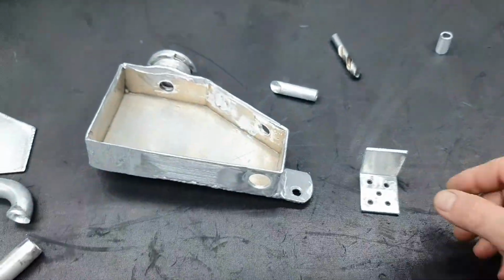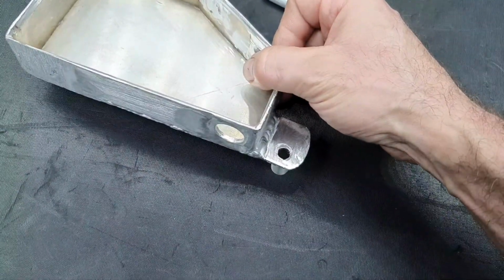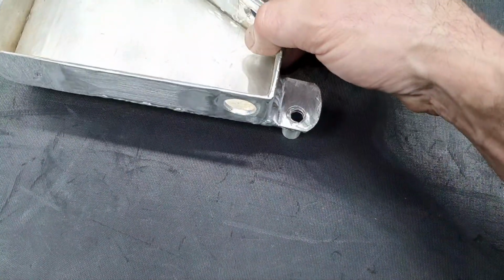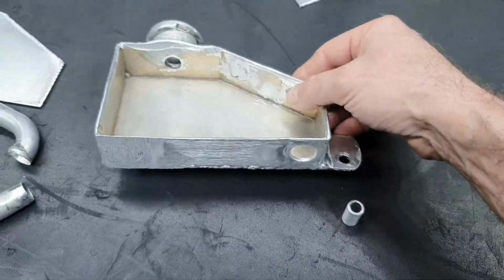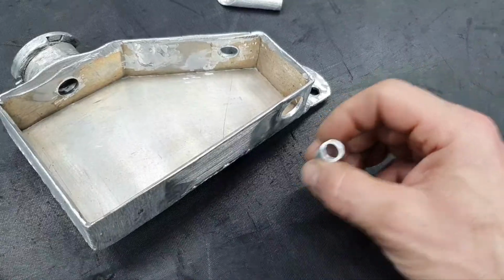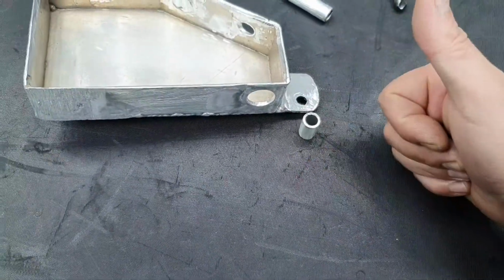Now, before I go there, there was this spacer behind this, and when you're opening the bolt, what's happening? This spacer fell down. We're gonna change that. We're gonna take the spacer and weld it onto the bolt, all right, to come together with the tank. So whenever somebody wants to remove it, they don't have to look for the spacer, you can easily lose it, or you might not pay attention, it might fall down and you're never gonna see it again. So it's gonna be welded here to be attached, to make everybody happy.